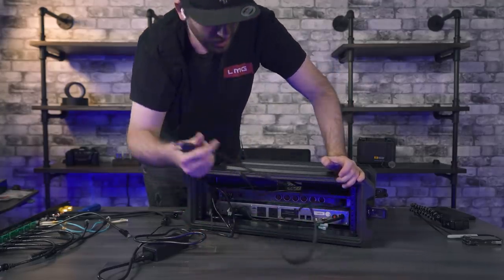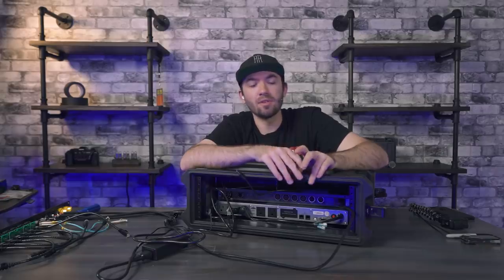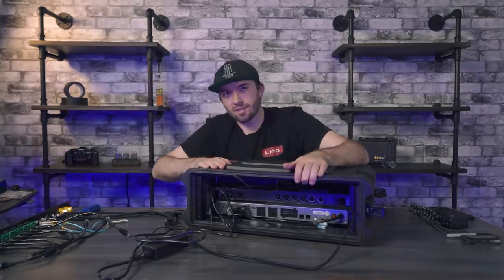You know me. The one thing I will do that I forgot about until I started making this video today is, in my other timecode rack, I use locking IEC cables just because it's one less thing to vibrate loose, and I forgot to grab some at the shop the last time I was there. I've got a whole pile of them that I use with the DJ equipment, but I just forgot to bring them, so I'm using regular IECs for now. But I am going to open this back up and do the RTV silicone thing and swap out the IECs for locking ones. Just in case you were curious. I know you were.